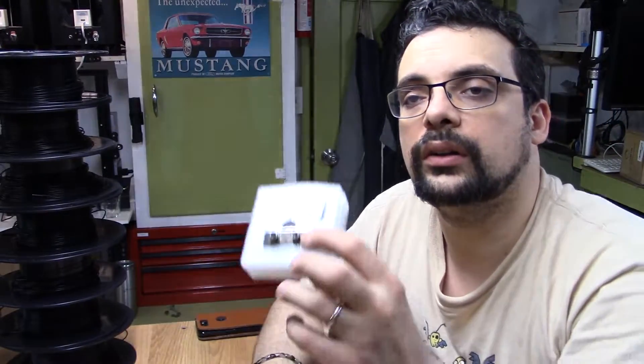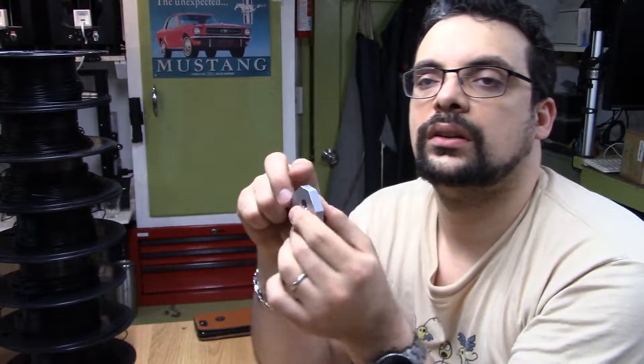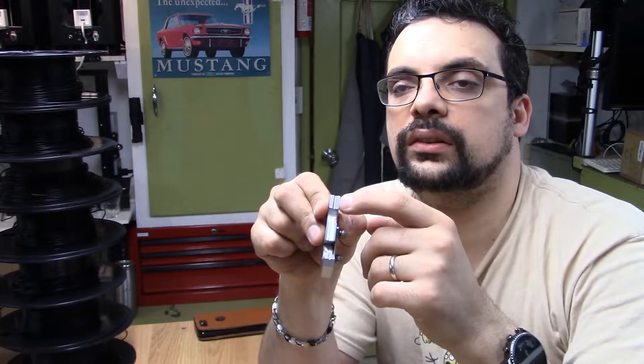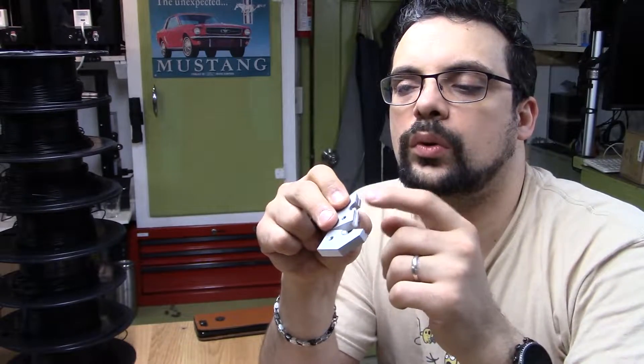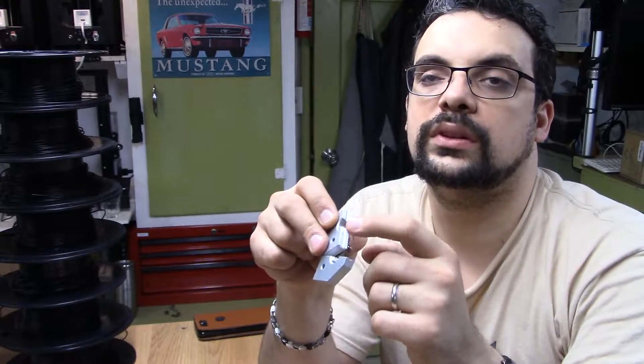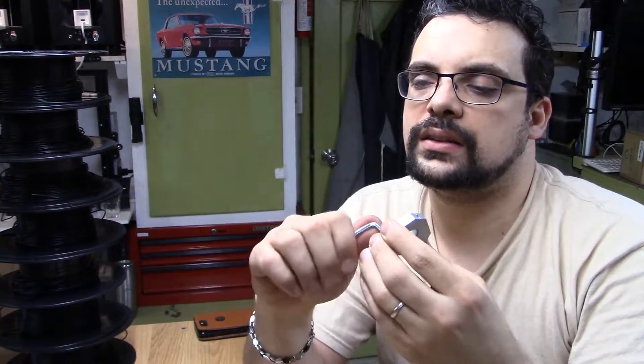Before we go ahead, this is what the filament joining kit looks like. It's small — basically it's a chunk of aluminum with a couple of nuts on it, comes with a little allen key, it splits open and there's a channel. A 1.75mm channel. One side is aluminum so you can get quick cooling and the other one is PTFE. While it's not the most precise thing in the world, I think it's actually pretty good for the money — about ten bucks.